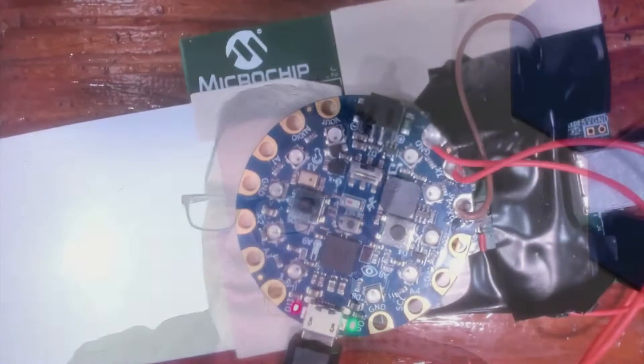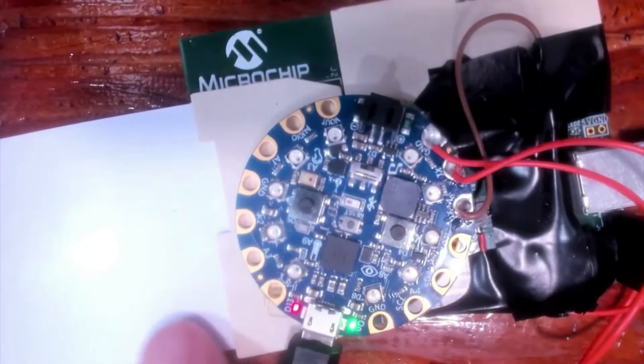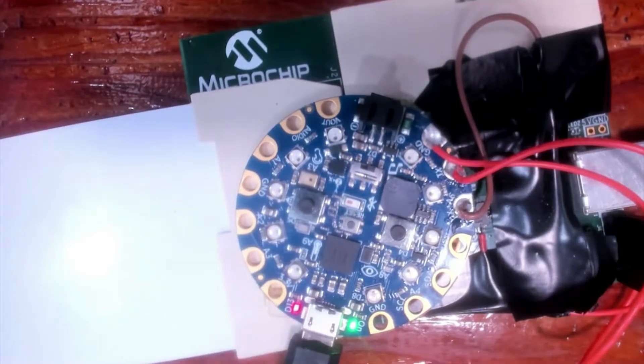What we have here is an iPhone which I have right here, and I have an app on it that's going to connect over Bluetooth. It has to send bytes back and forth using a protocol — the BLE UART protocol, which is just a serial stream of bytes. That works really well because it's the same stream of bytes we need to send from this microcontroller to this card reader.